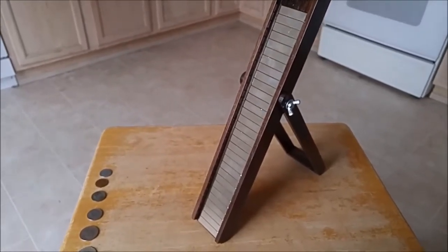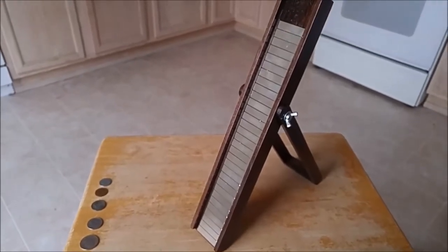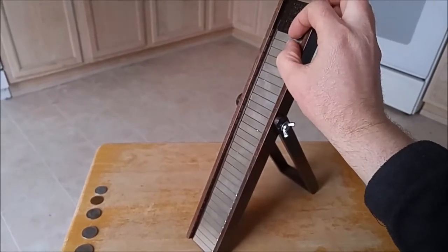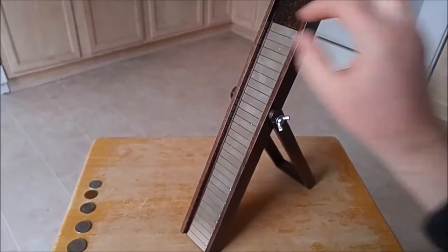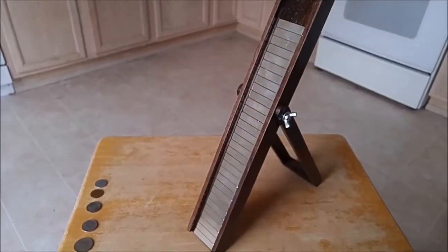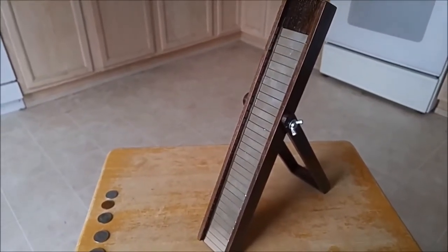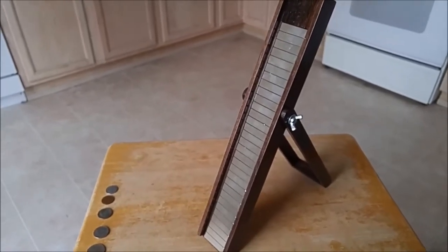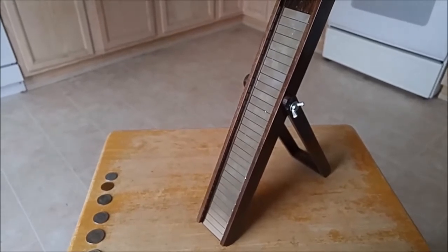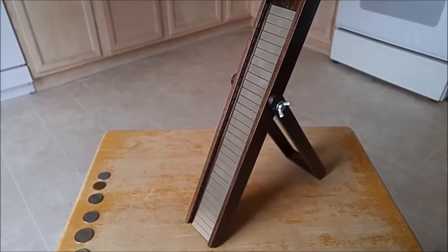Several factors affect the strength of that opposing magnetic field within the coin. It's dependent upon the strength of the magnet being used, how quickly the magnetic field changes — how quickly the coin slides down or how thin the magnets are. How close the coin is to the magnets also matters; I don't have any cover over these magnets so the coin will be touching them. Importantly, the conductivity of the coin affects how much current flows — that's the big one that can differentiate between different types of metal.